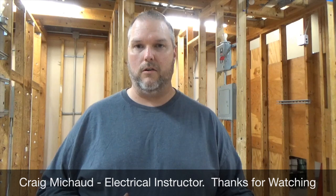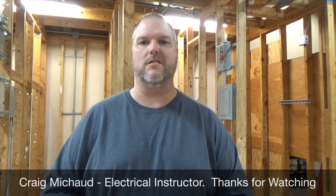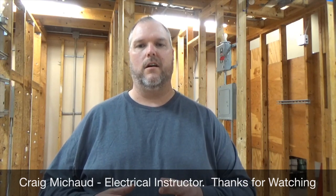There are a ton of different techniques you can use. You can use the half hitch method that I just showed you, or you could use the buddy loop hook method like I've used in the past. But realistically, when I'm pulling THHN, I personally like to use this half hitch method. It just makes life that much easier and it's so much smaller when you're trying to take a larger amount of wires.